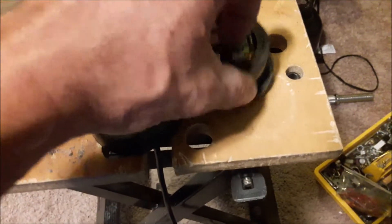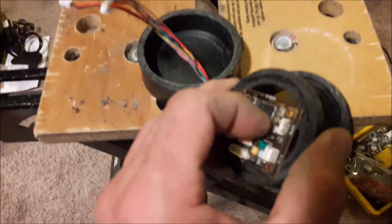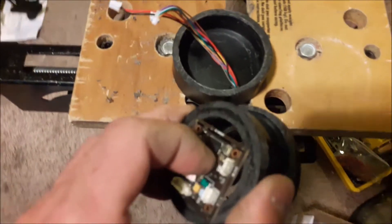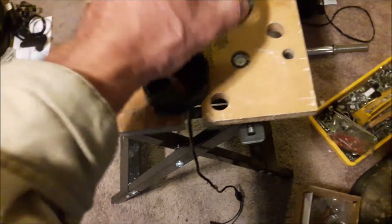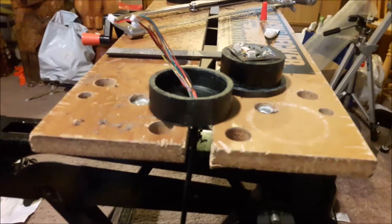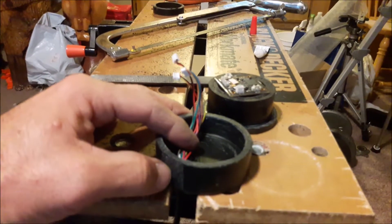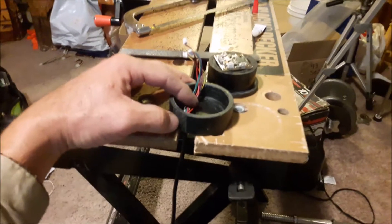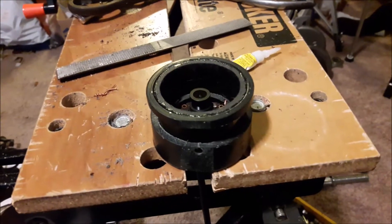I can mount the board camera on the back of that and insert it into the housing, fitting inside with the lens on the front. It'll slip into place with clearance for the cable coming through and for the connection on the back. Then I'm going to put a quarter-inch by twenty threaded mount right back here, assemble it, and test it out to see if it improves visibility.